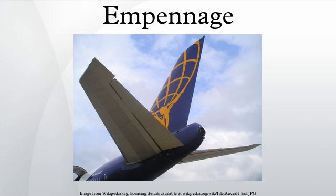The fin comprises the fixed vertical stabilizer and rudder. Besides its profile, it is characterized by the number of fins — usually one or two — and their location on the fuselage, tail plane, tail booms, or wings. Twin fins may be mounted at various points. A twin tail, also called an H-tail, consists of two small vertical stabilizers on either side of the horizontal stabilizer. Examples include the Antonov AN-225 Mriya, B-25 Mitchell, Avro Lancaster, and ERCO Ercoupe.